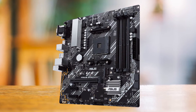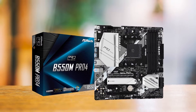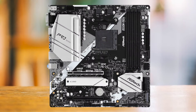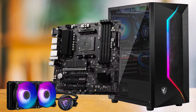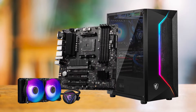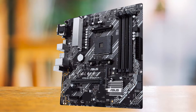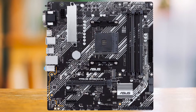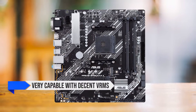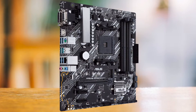The best alternative to the ASUS Prime B450M-A2 is the ASRock B550M Pro4, but that is a $100 motherboard. It's excellent but doesn't come with Wi-Fi pre-installed, making it effectively $110. At that point, it competes directly with better boards like the MSI Pro B550M-VC Wi-Fi, which offers a stronger VRM, Wi-Fi, and more USB ports at $120. That's why I chose the ASUS Prime B450M-A2 as my final pick for best budget motherboard — under $80 it blows everything else out of the water, and adding Wi-Fi is just a $10 add-on.